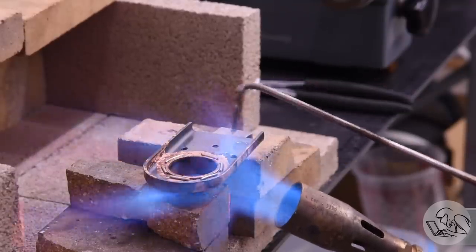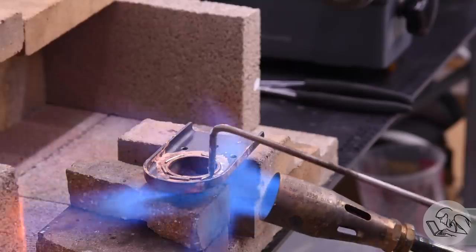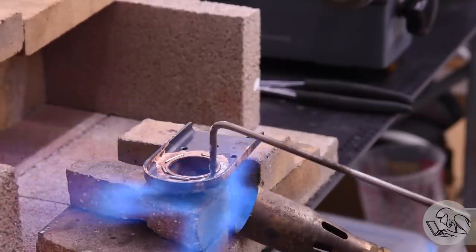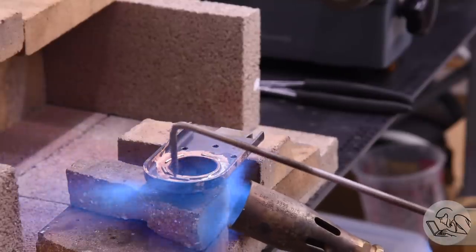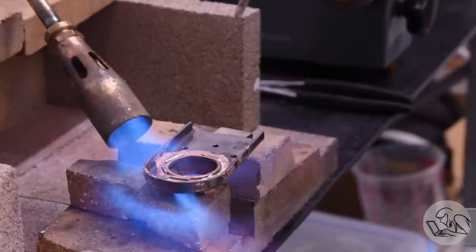So there's the foam melted down there, and you can see that it's just about to turn into water, and you can see the silver solder starting to get soft there, and there's the magic right there. The silver solder started to flow on the front joint there where the heater's closer to it, and this is where the scratch rod really comes in. You can use it to move the molten solder around and make sure that the entire joint gets good coverage.